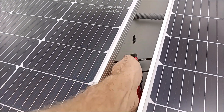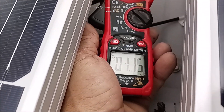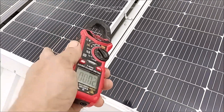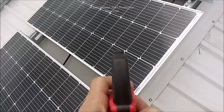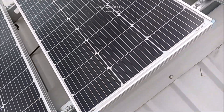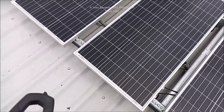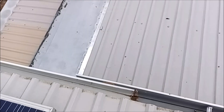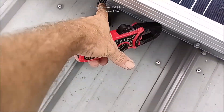I'll get in here — I'm not blocking the sun and it's showing 1.13, 1.15 — so that one's okay. But if I check this one over here and it says 0.79, and this one says 1.13, then my problem over here could just be a dirty panel. You've seen what happened when I put my hand on the other panel — it could be something as simple as one cell having something oily or a bird dropping. I just want you guys to understand how these actually work, so when you're doing a job and something's not going well, you can test by just checking the cables.